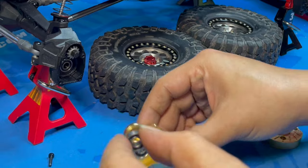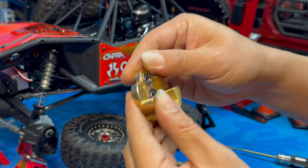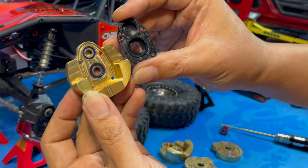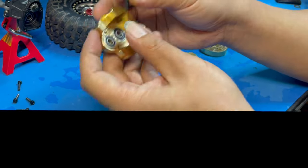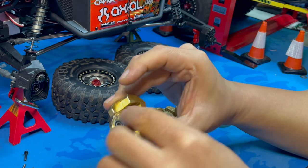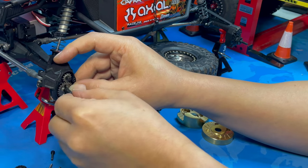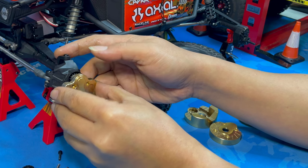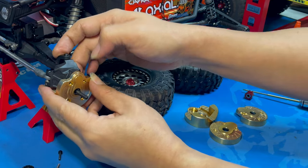This bearing will go into the brass housing. Same as what we did on the other side - just flatten it a bit and push it in. We need to put some grease before putting it in. The grooves on the housing are the same as on the brass. We try to fit it first before greasing. Put this one inside, then this one goes in - just try it this way and it should go in well. Then try to rotate on the other side to confirm.